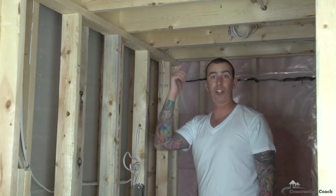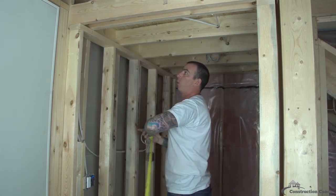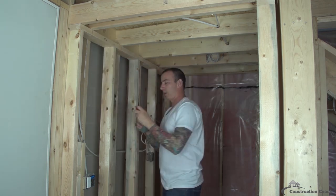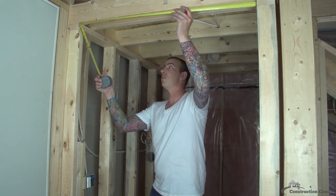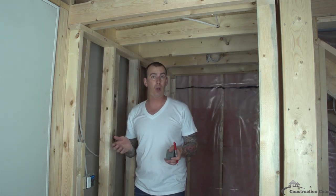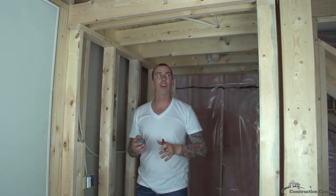Now I'm going to measure for the ceiling board and set up to install it. So I've got 71 3/4. And I just need to get a width. 41 3/4 tight. So because the drywall is coming up the walls, I can be a little smaller with the drywall so that it's easier to get up there. So I'm going to go with 41 5/8. That's just 1/8 more space to maneuver the piece of board up into the position.